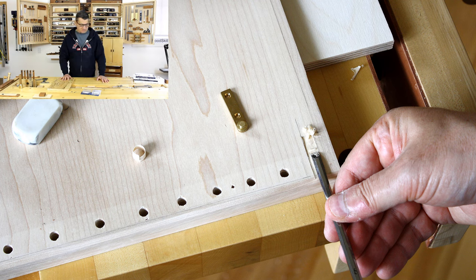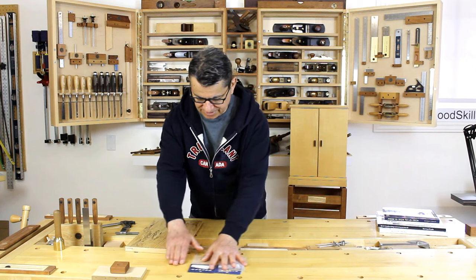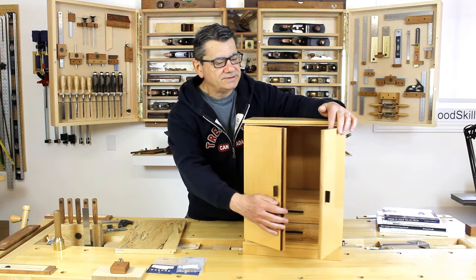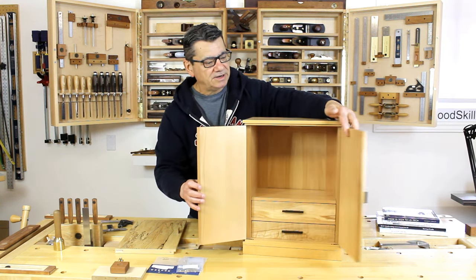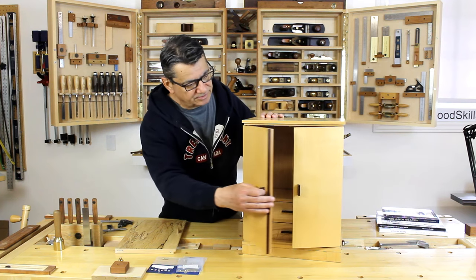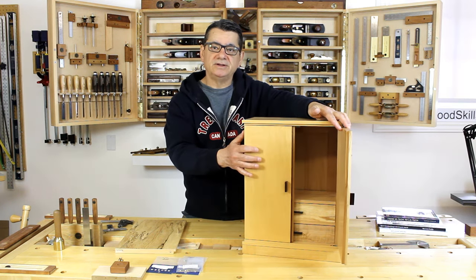There is some adjustment if the doors don't quite meet in the middle — this is a critical part where they meet. I'll separate this and place it here so I can show a more detailed look at the actual cabinet. This is one of my smallest cabinets, with doors with an overlapping portion here. You can see how concealed the hinges are. Most people are not familiar with or have never seen knife hinges in a cabinet before. It's a nice feature you can add in your own furniture making to raise the quality and the cachet of your work over a competitor's.